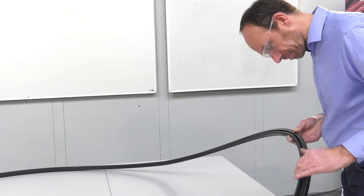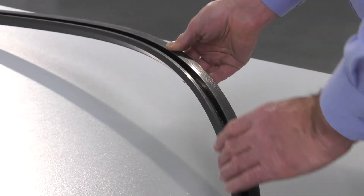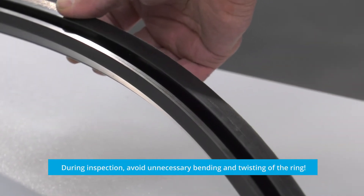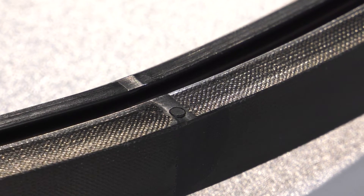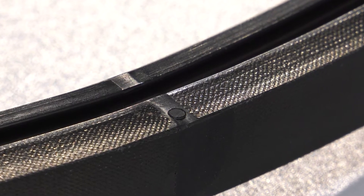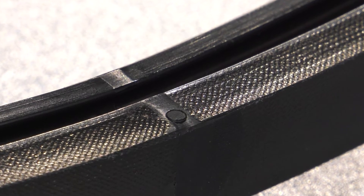As a rule, all types of radial shaft seals must be checked for possible damage during transit prior to installation. The sealing edge and sealing lip must be undamaged along the entire circumference. Be careful while doing this work — avoid unnecessary bending and twisting of the ring. This applies in particular to the region of the joint of a precision-jointed shaft seal. A joint is precision-made with a view to its function, and must withstand only low lateral forces once installed. Manual bending or twisting prior to installation causes unnecessary stress peaks, and related material damage can occur in all areas of the ring.